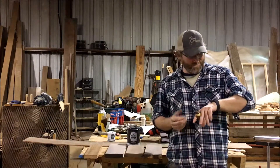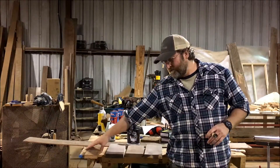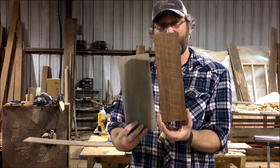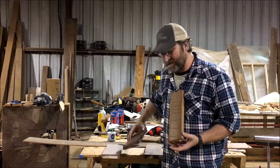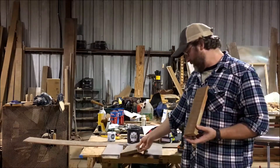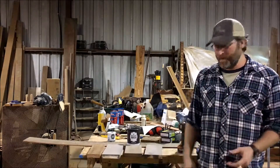It's been a good three to four hours since I put on the last coat. They still feel kind of wet, but they are dry to the touch for the most part. So far they're not really turning as brown as I was expecting — they're more of a weathered gray. This is the poplar, and this is the actual reclaimed barnwood. You can see some light brown tints in there. Again, after the first coat, the oak is looking a little more brown, taking the brown a little more than the other two — so far, this is the winner. I'm going to go ahead and try putting a third coat on them and let it dry overnight with a fan going to help with the drying process. It's all experimenting.